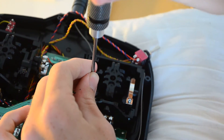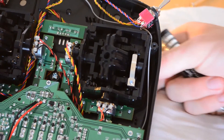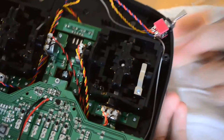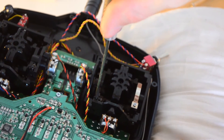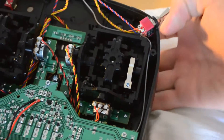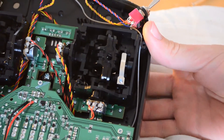So here we go — I'm just going to go ahead and unscrew this very carefully, remembering that it's a plastic part. And you see, that makes this entire thing much smoother — this rudder input. If you actually want to tell the difference, you can screw it in a little bit more than it was originally and feel the difference: that's a very rough gimbal, but then this is a very smooth gimbal. This little platform that the bolt's in is actually moving up or down as I adjust the screw. What it does is adjust the height from the spring to its contact point on the gimbal, meaning there's less or more tension on the spring, making it a smoother or rougher transition. I've adjusted it — that feels much better, and I think I'm going to keep it right at that.